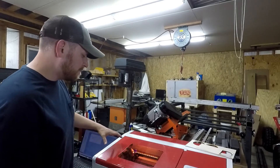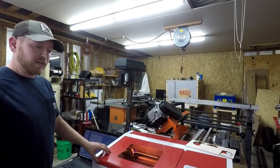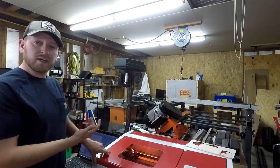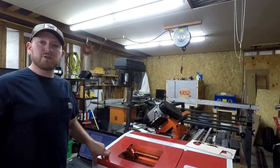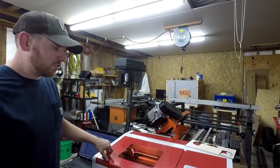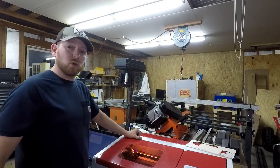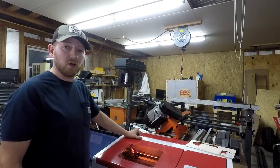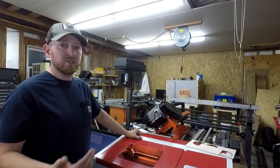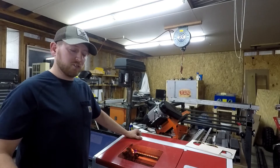All I do is boot it up, initialize the laser, then you can unlock the rail, move it around to where you need, hit a test fire, and you know exactly where you're cutting. There are a lot of tutorials out there so I'm not going to go too far into how K40 Whisper works. Suffice to say it's been excellent thus far, so if you need a new control package I highly recommend it. And it is free, so there's that as well.